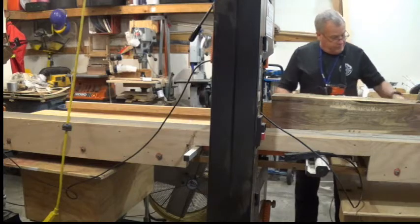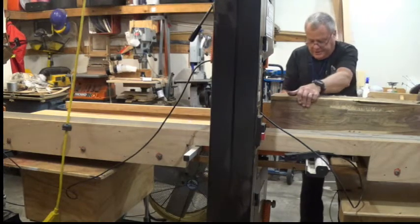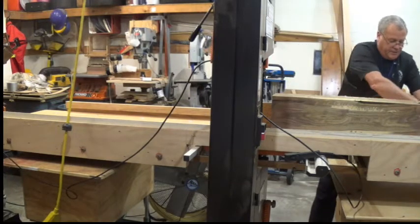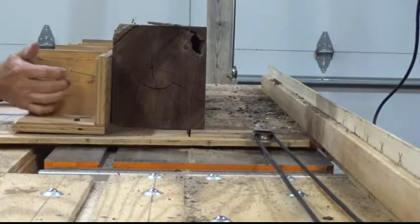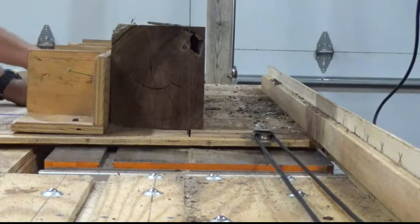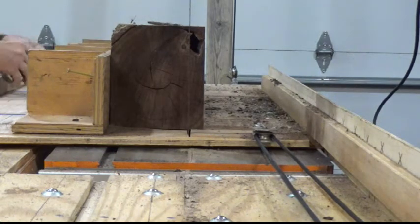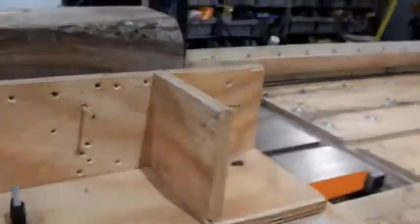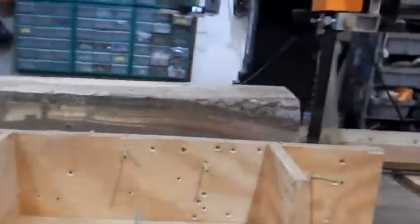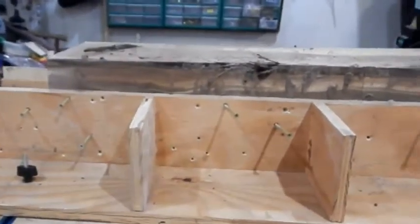That's the one-inch reference line — they're parallel. Loosen that up and move it to the next one-inch line, which is about right there. I just drew these lines on there as I did my first set so I didn't have to remeasure things. And an inch, inch and a quarter — I think these are inch and an eighth. They're about an inch full, inch and an eighth. I wouldn't go less than an inch. By the time you get done planing and everything, you're going to come down with a three-quarter inch board. So if you're wanting a heavy three-quarter, I'd probably go inch and an eighth on those cuts for sure.